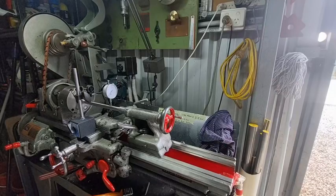It's not too bad for most work. A lot also depends on the surface of what you're turning — to me that's another critical thing. The type of metal matters: with mild steel you get the worst finish, and the diameter measured with a micrometer is all over the place because the surface finish is terrible. With bright steel the finish isn't that brilliant either. You really need to go to tool steel to get a really good finish. This test bar has been ground on a precision grinding machine.